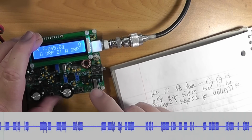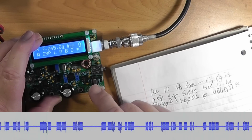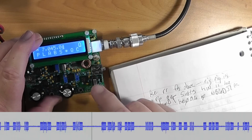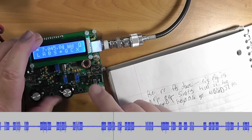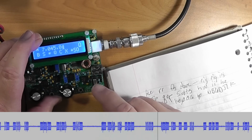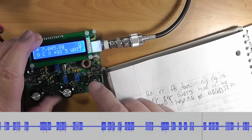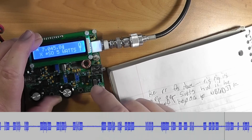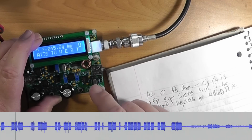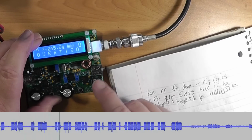You know, a 5-watt light bulb, even if it's LED, isn't all that bright. And light is a form of radio wave too, and to have that light go all the way to Los Angeles, especially considering this is going out an omnidirectional antenna, so I'm spraying power everywhere, in literally every direction. And so the amount of power that reaches this guy in Los Angeles is minuscule, many millions of times less than what I'm sending out, and yet he is doing pretty well there.